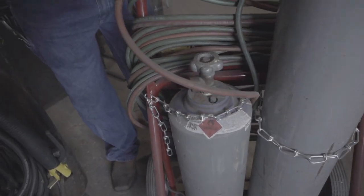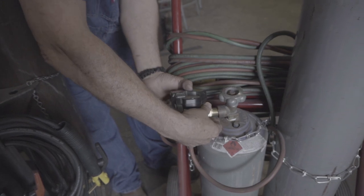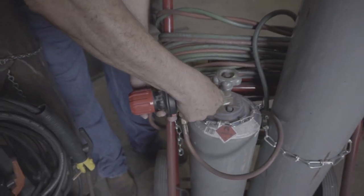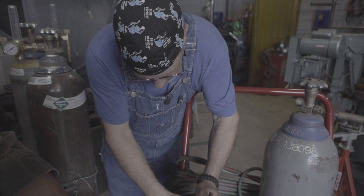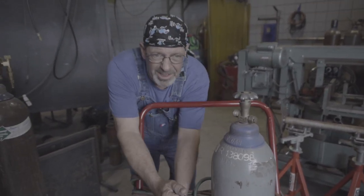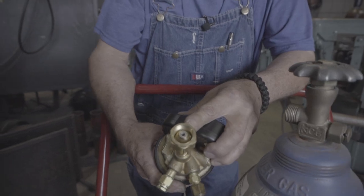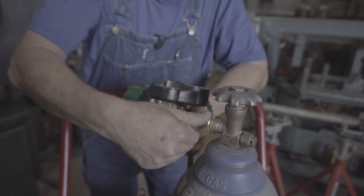The left-hand male. Let me get around here at the right angle. So this is acetylene, and which one is this? This is oxygen — pure oxygen. Acetylene, we use that one-piece tip, but when you go using propane, natural gas, propylene, you need to have that two-piece tip, and that's vitally important. Okay, what's this one here? We've got right-hand thread, a female. Let me put this rascal on here and get him started.